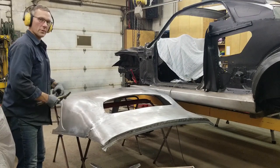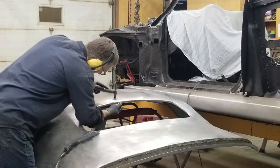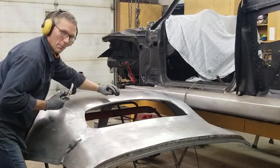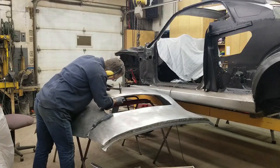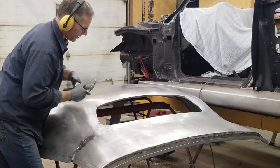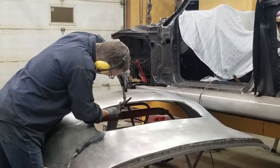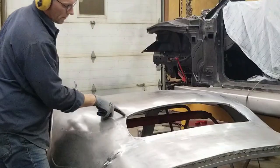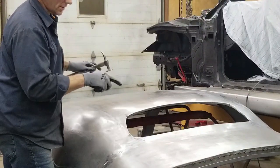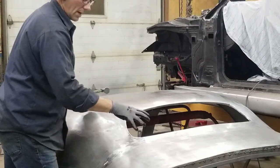So with that fixed up there and that door feature done, I'm going to get into this area through here, tighten up this radius, make it a little bit sharper so that we can create a template for this rear window. I'm just making that edge a little more crisp, and if I see any little bumps in there I'm just taking care of them. The way I can tell where I left off is the metal is a little more shiny after you hit it. This corner here I left not welded intentionally — I stopped the weld right before it rolled down inside. Once we get the roof up on the car and everything's sitting in the right spot, then we'll weld those corners up, because right now they're moving around and if we weld that in the wrong spot, we'll have a weird tension in the panel that shouldn't be there.